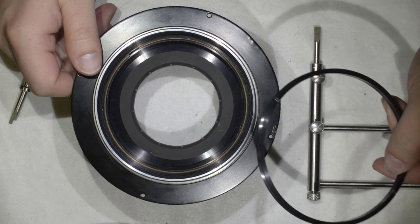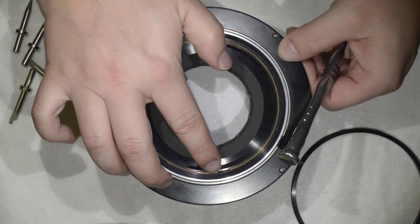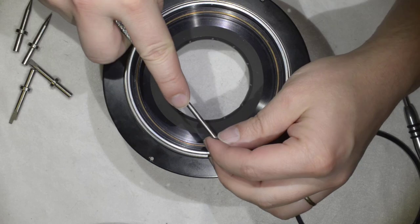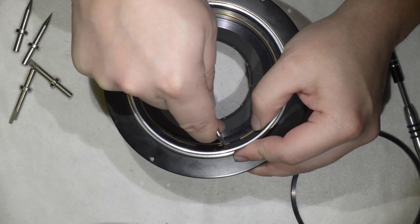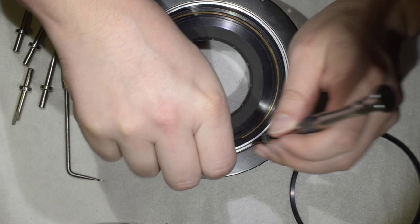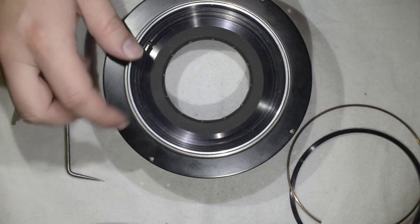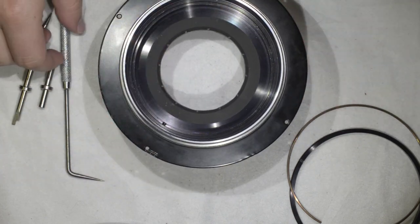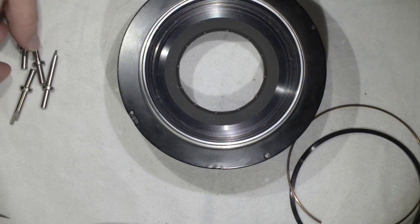Okay, so I remove the ring, not the easiest task, and then you have this retaining ring here, and for that I got this hook here, and then I just need to pull here, and then put something behind, and once it is out, it comes out quite easily actually. This is the advantage of working with big parts. Then here you have a pin here that actually goes outside here,